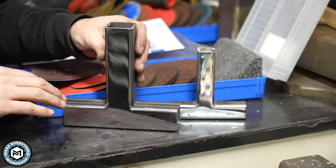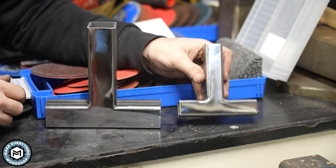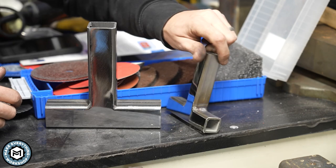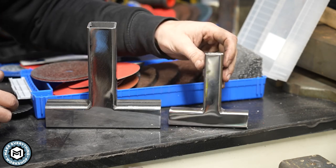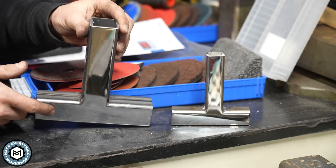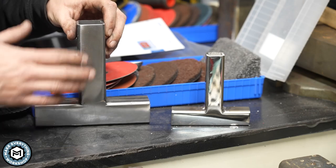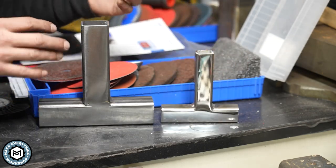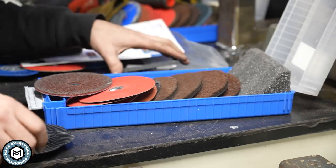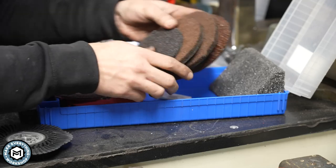Similar processes for two different materials. You can kind of see the difference — the stainless is extremely mirrored, looks really nice, and picking up a lot of stuff even at a distance from across the shop. The mild steel has a pretty nice finish as well, but it has some grind lines and grit in it, and then this side with just a uniform finish. What I really like about these discs is there's a good variety — a bunch of different types of surface finishing discs in different coarseness depending on the finish you're going for.